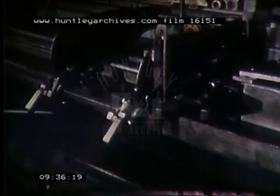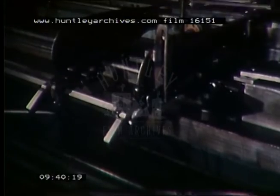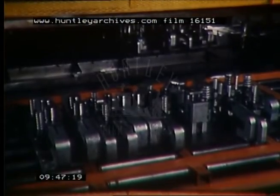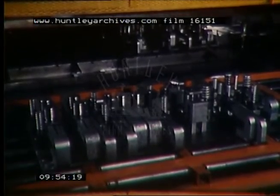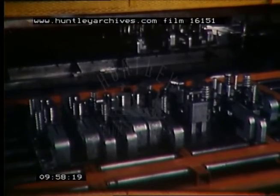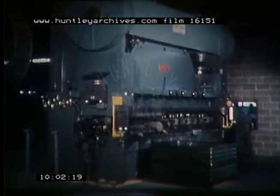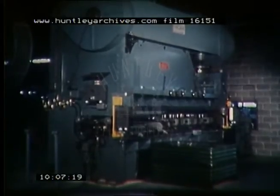All sizes of the front and back covers are formed to 90-degree U-bends with wrinkle-free flanges in a Chicago double-wing tangent bender. Individual punch and die units are removed and added to the die plate to produce modifications. In changing from one size cover plate to another, the die plate with all punches is removed as a unit, a complete setup for the next size is substituted, and the necessary changes in the cutoff die and ejector section are easily made, so that the complete change is accomplished with minimum press downtime.